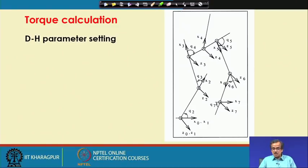Now, in short, let me tell you the procedure of how to find out and determine the joint torque. I have discussed this in much more detail while discussing the dynamics. Now, let me proceed a little bit faster. So, this is how to assign the coordinate system at the different joints according to the DH parameter setting